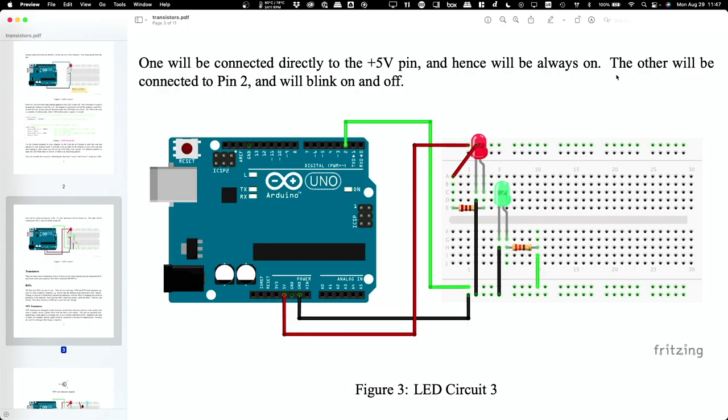Okay, that's not connected, right? Remember, in the middle, it's in groups of five, so you'd want it like here. Okay, does that make sense? So these five are connected internally, but this one and this one are not connected. Now on the top and the bottom row, they are. Exactly. In the middle, it's the columns rather than the rows.